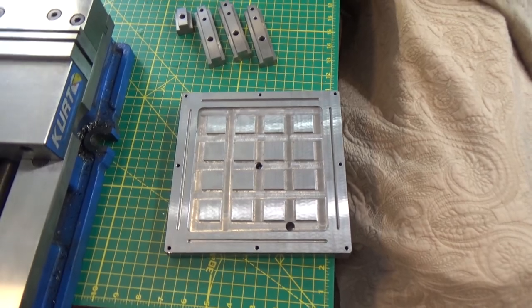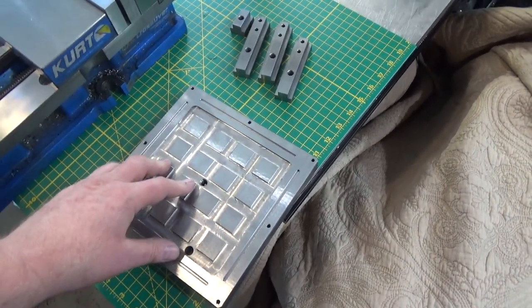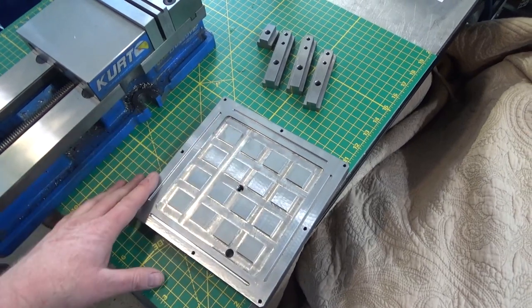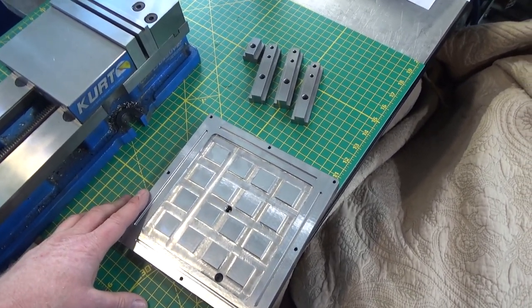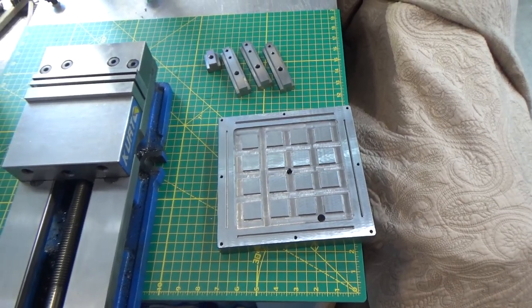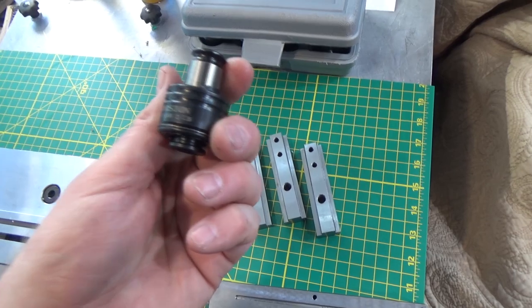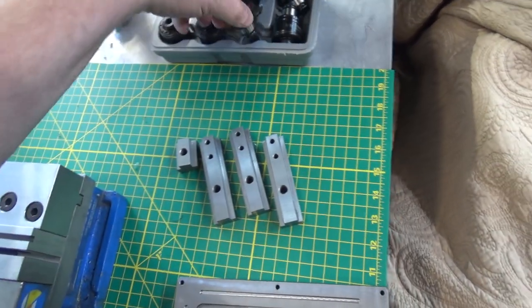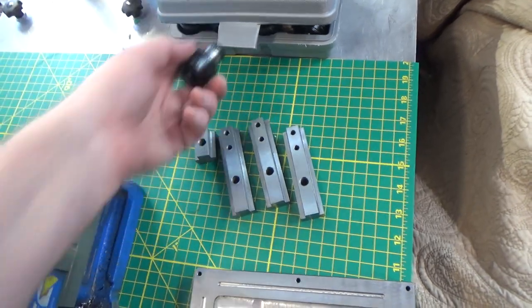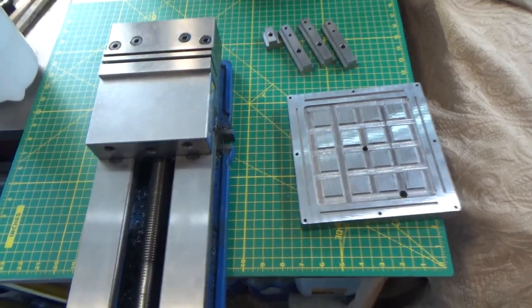For those of you who watched my review and didn't see me tap steel — I knew I was doing this, and at the time didn't have any scrap steel, so I will be tapping all these holes, going from easiest to hardest: 3/8, then 1/4, then number 10. All these are 70% threads, so they should present a challenge as far as protecting against breaking taps. The torque collet settings from the factory may not really match what they say on the side — this one says 7.26 Newtons, this one 9.14, and the really small one is 3.86 — so they may not protect as well as they should without some adjustment.